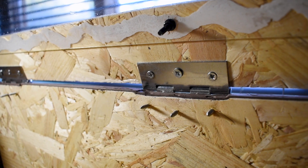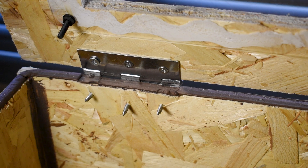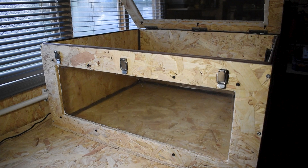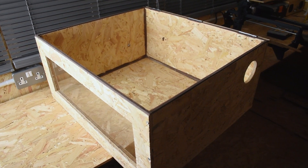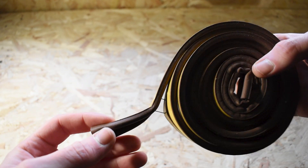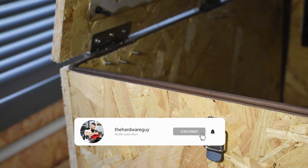To install the lid I used three generic hinges. When installing the hinges you'll have to tap out a recess into the top edge surface — this ensures that you have a flush seal when the lid is closed. One of the most important elements is the seal between the lid and the enclosure. I initially tried using foam for this but it didn't work very well. My recommendation would be to use rubber window seal — this is used to prevent drafts on PVC doors and windows, and if it's good enough to keep the elements away then it'll certainly be fine for keeping laser fumes in. Keep in mind that this is also likely to be a serviceable part, so keep some lying around and replace it in the future if necessary.